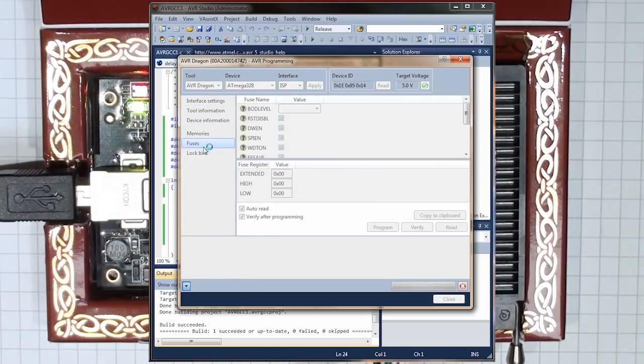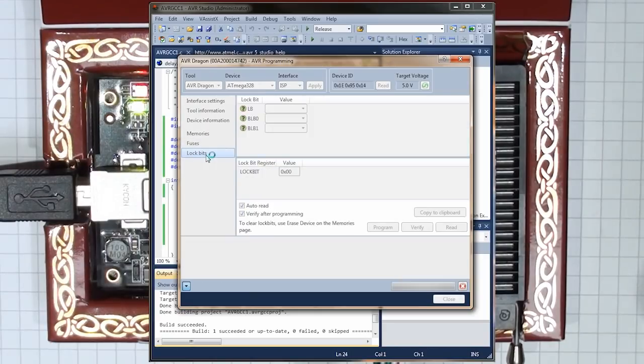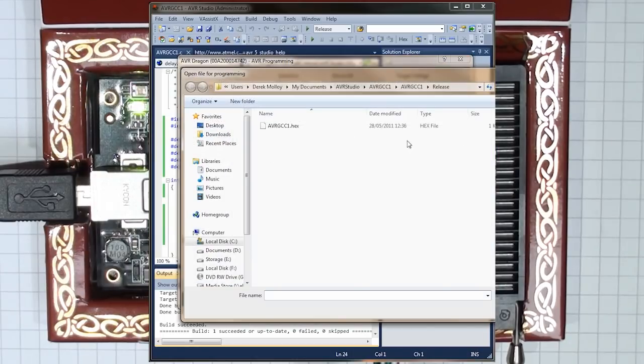We can see the fuse bits where we can decide if we're using an internal oscillator or not. Also the lock bits, and importantly make sure you have none of these set before you go into debug wire. So here's the memory section, and we can erase the IC just to check that everything is working. It's working perfectly. And then we can choose the output of our build, which was the hexadecimal file. So we can browse to the directory and find the hexadecimal file from our build,